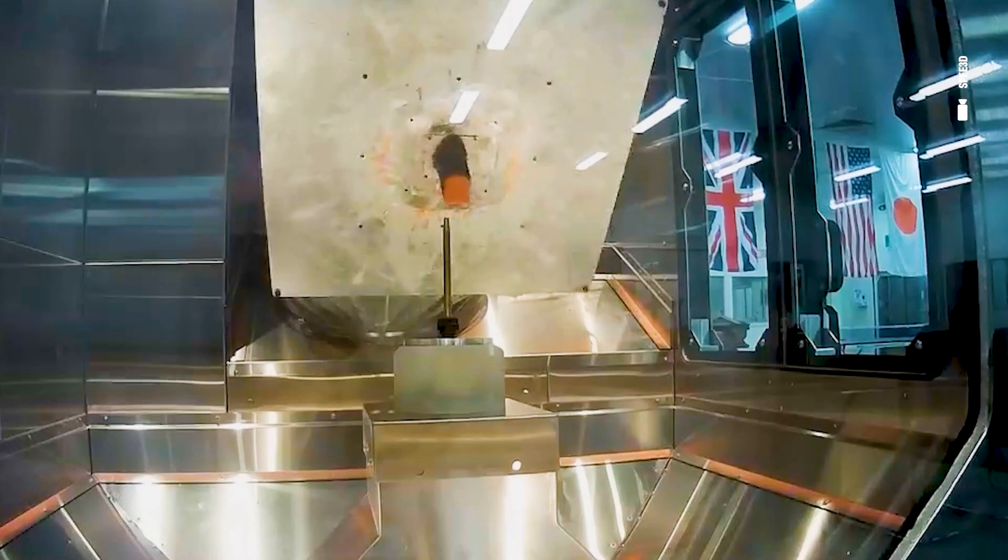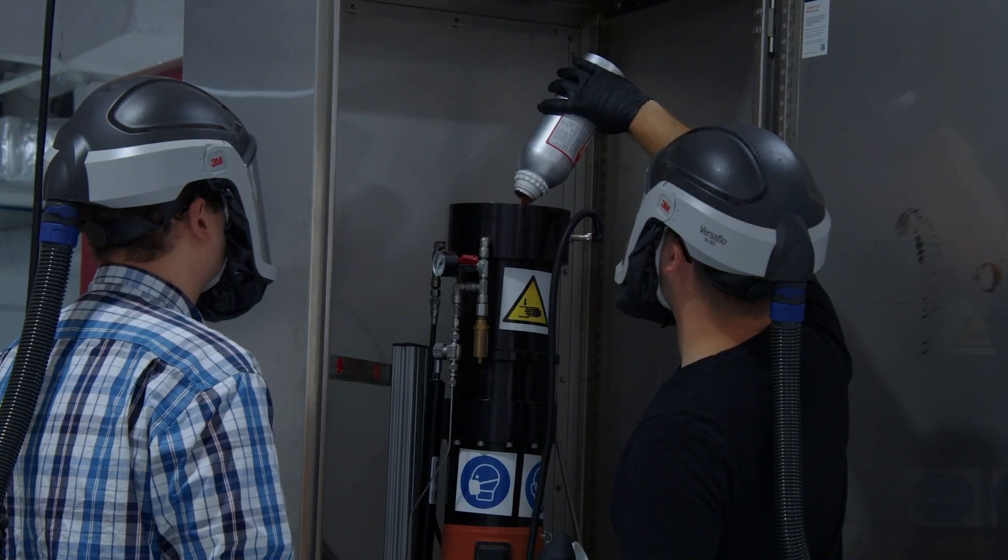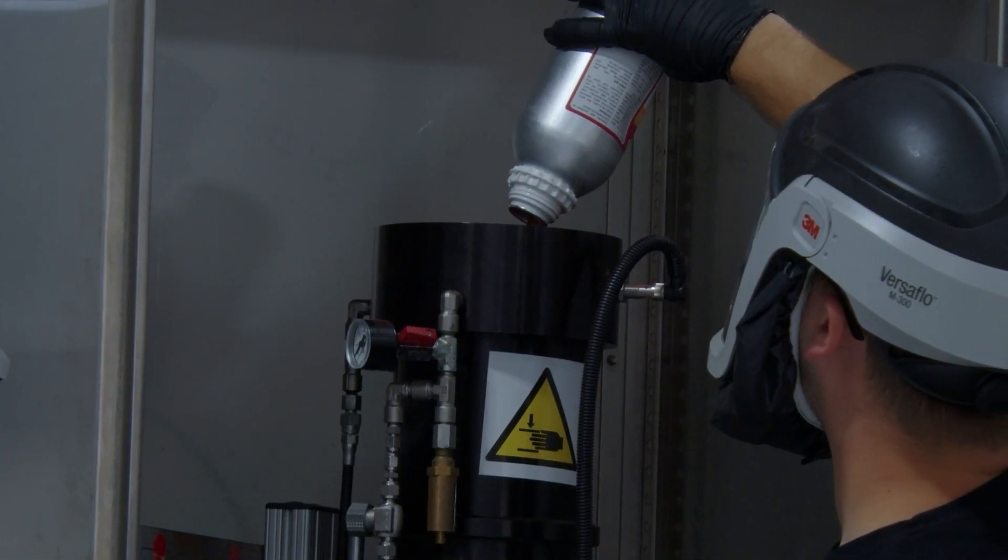I love watching the warp speed 3D print. You start with metal powder, but instead of a laser coming by and sintering and melting the material together, it uses high-pressure air to actually blast it into a metal build plate, and that kinetic energy builds up the material.